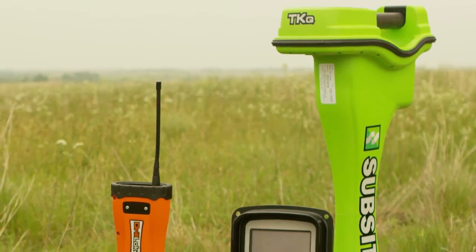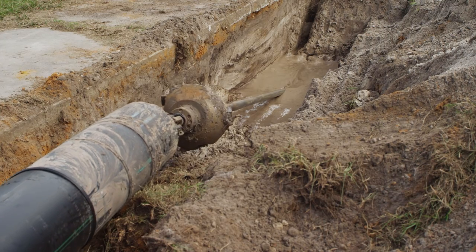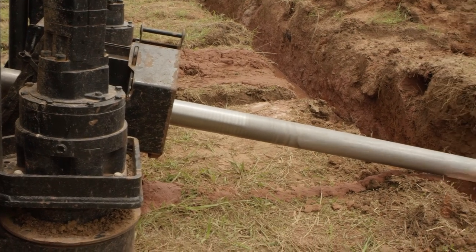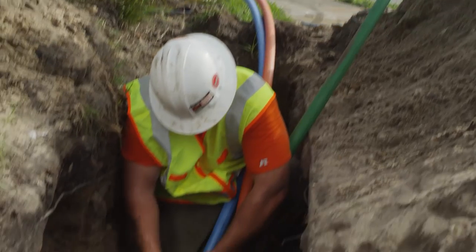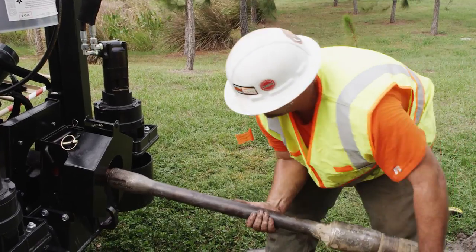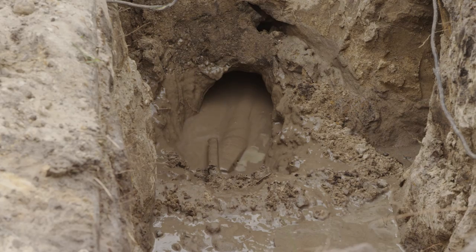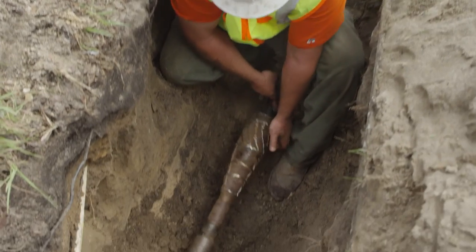It is not a replacement for the operator's manual. Always read and thoroughly understand the operator's manual. Lockout tagout procedures help protect you from hazardous energy and provide a means to keep equipment de-energized while work is being performed in hazardous areas. Rotating drill pipe and tools are hazardous and can grab an article of clothing or hair and crush or kill you. Use some form of proper lockout tagout procedures while changing downhole tools or during other times when the drill string is exposed and workers are around it. Think of tracker control or drill lock system as your convenient lockout tagout system at the exit pit. It locks out the rotation power and hydraulic lock thrust within 16 seconds, therefore locking out the hazard's energy.